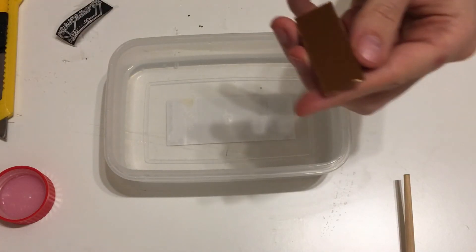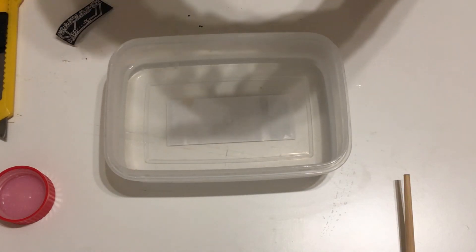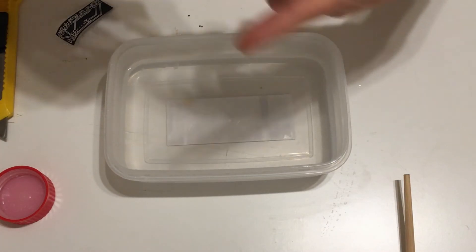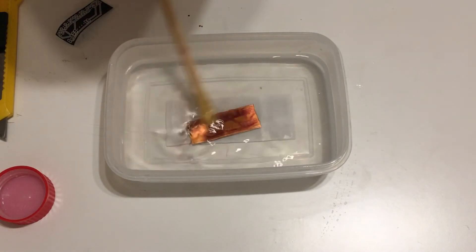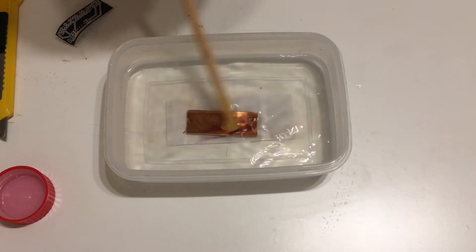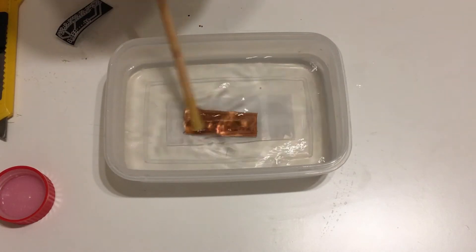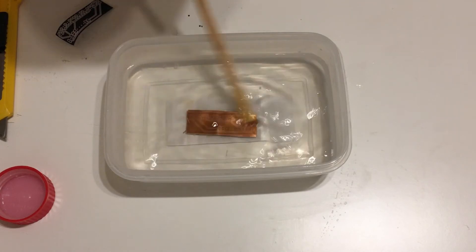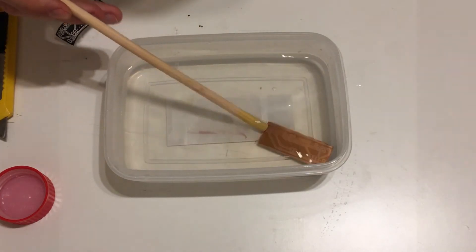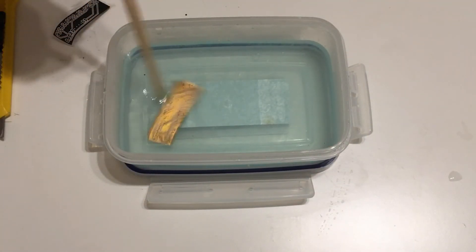Now we are going to dip it in the solution and carefully move the liquid around it. Make sure you do not touch the film otherwise it might get damaged, so you have to be careful. Alternatively you can also move the vessel with the fluid. After several seconds the film is developed. Also make sure you do not touch the liquid with your fingers, otherwise it might cause severe chemical burns because this solution is strong. Once the film is developed, make sure you wash the board as soon as possible with clean water to remove remains of the sodium hydroxide developer — if you don't, the film might get damaged again.